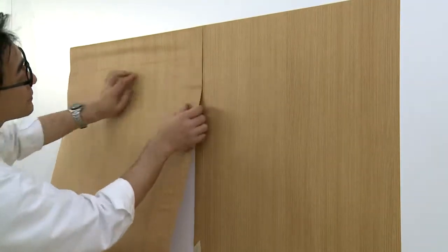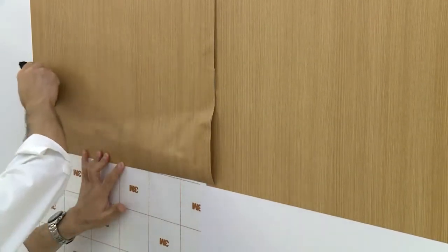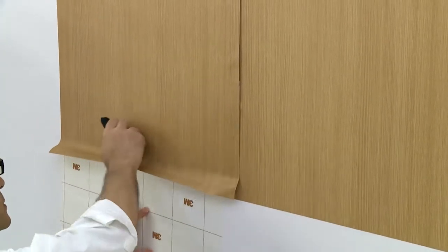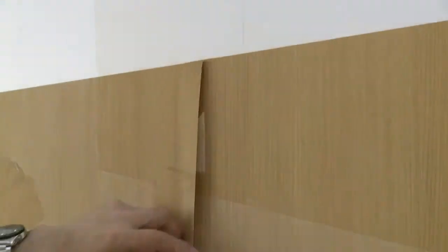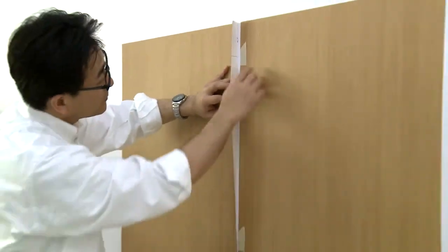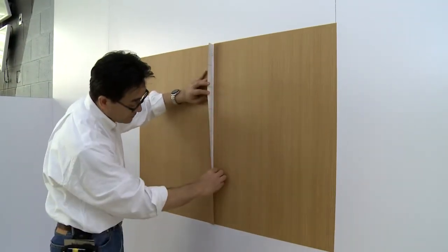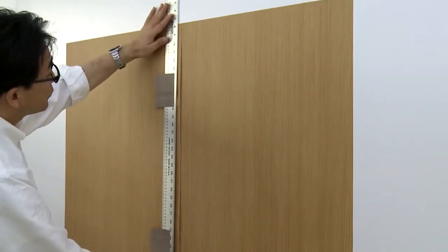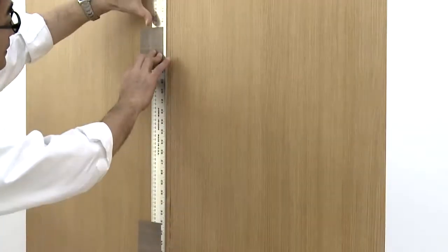Lightly adhere the film to the wall. Then, using the techniques described earlier, continue pulling down the liner and squeegeeing the film. Check alignment often and re-squeegee the edges. Roll back the overlapping edge of the second film panel and remove the masking tape. Align a ruler with the center of the overlap and hold it in position with a scrap of film.